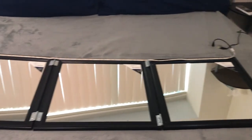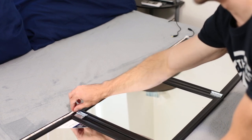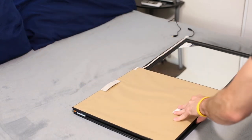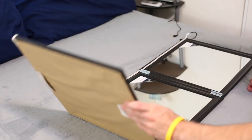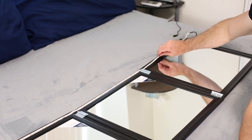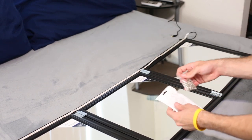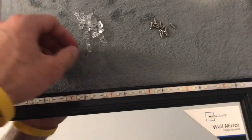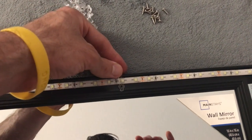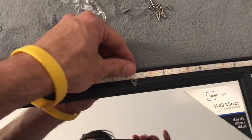Let's redo that fold test. It turns out you don't need huge gaps at the hinges — you just need a little bit extra. It folds over quite nicely and seamlessly. But the adhesive is not that great on its own, which is why we have these mounting clips. The next step is to take the mounting clips and put about three or four on each mirror so the LED strip stays in place. How these mounting clips work: there's a hole in the bottom, you set it on top of the LED, take your screwdriver, make a little pilot hole, and send a screw through the hole. Add about three to four to each mirror depending on how secure you want it.